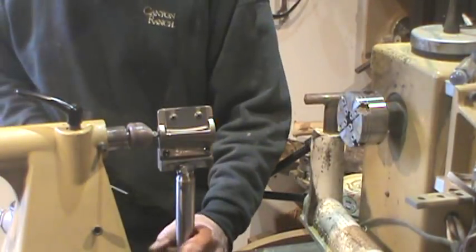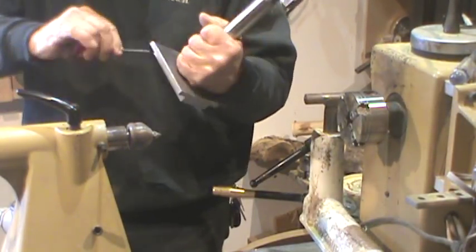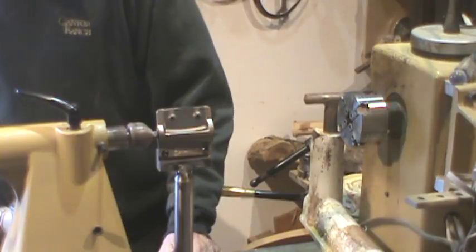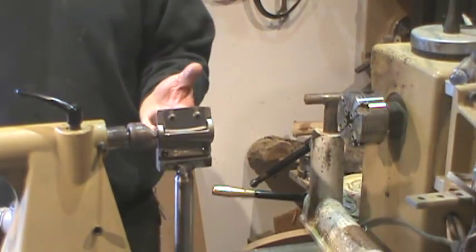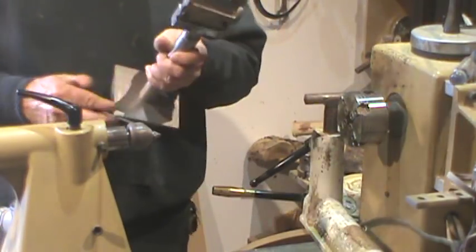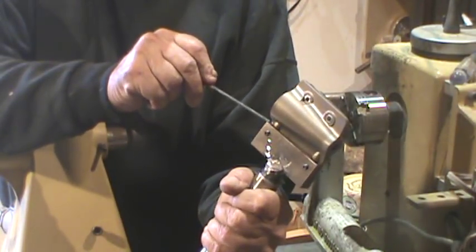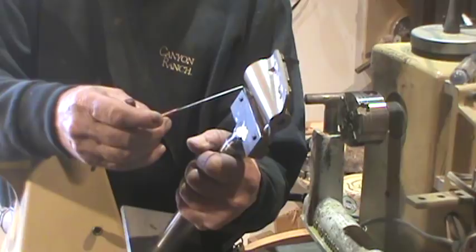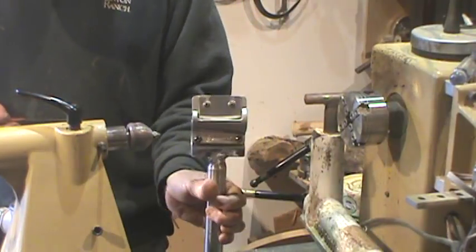Okay, what I need to do is screw this one out and this one in. Now, as far as I can tell, it looks pretty close to center. The biggest problem is I'm high on the whole jig. It's not lost, because the way Veritas set this up, I've got a couple of bosses right here that sit on the top of this. I'll take this over to my friend's machine shop and machine off 1/16 of an inch right here, because I already know how far off it is.